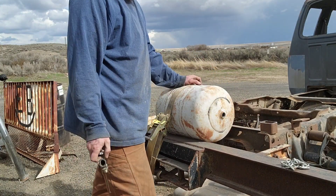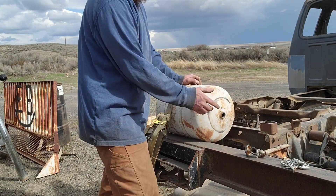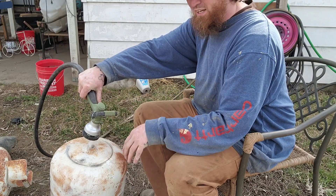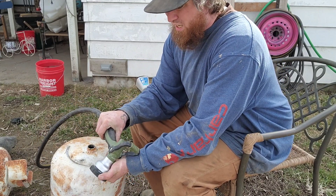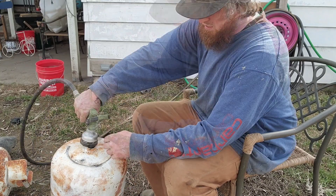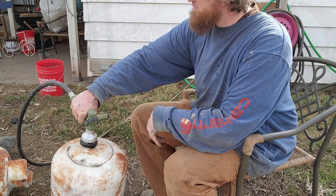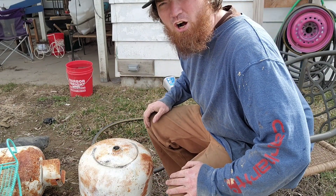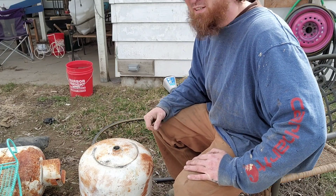It still puffed a little - you can still smell a little bit of propane. So we're going to go ahead and fill it with water again. I can't stress to you enough how stupid drilling into or welding on a propane tank is. So if you have any kind of brains, don't follow my instructions. I'm going to go ahead and fill it with water so that when I go to drilling into this thing and welding, we don't have to worry.